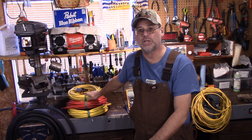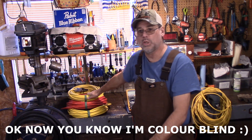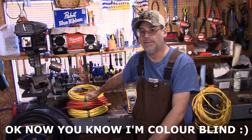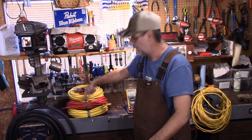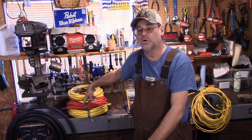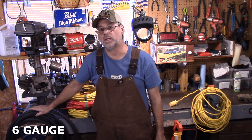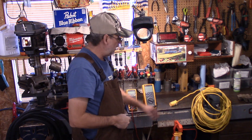I've got a hunk of wood and three extension cords here. The two blue ones are 100-foot cords — I made two 50-footers out of them and they are 12 gauge. I've got a 100-foot extension cord in the middle that's 14 gauge. And this one over here, number six, that's for my 220 welder so I can weld out in the driveway — each 100 feet.